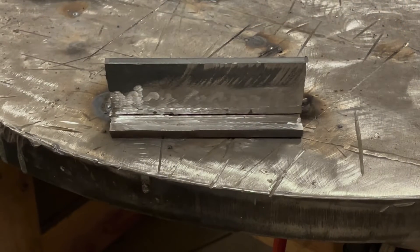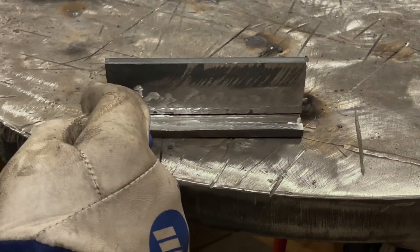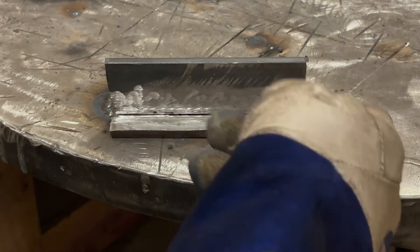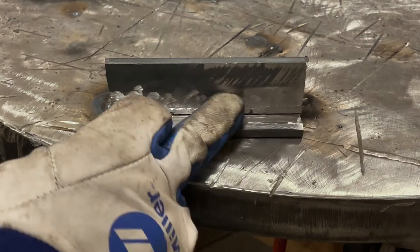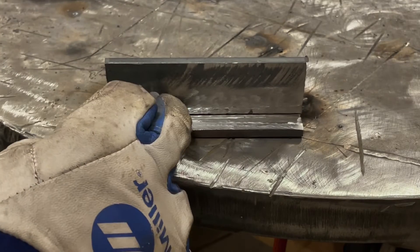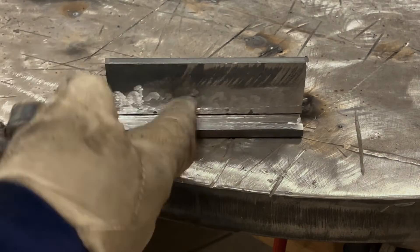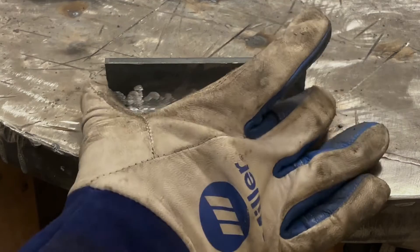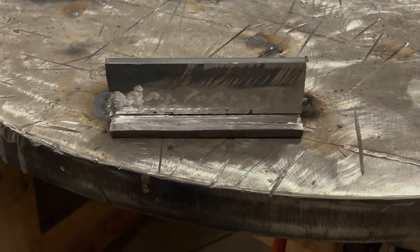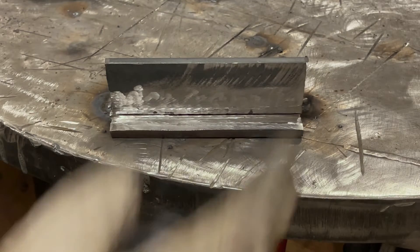This cleaned up a little easier than I expected, simply because there was no penetration to the root — so just by buffing all that junk off we got a pretty clean edge. Normally you would have some root penetration and might have to grind quite a long ways into that root to get it cleaned out. But right now we're set to re-weld this, so I'm just going to grab a 7018, run a single pass after I tack it, and call it good.